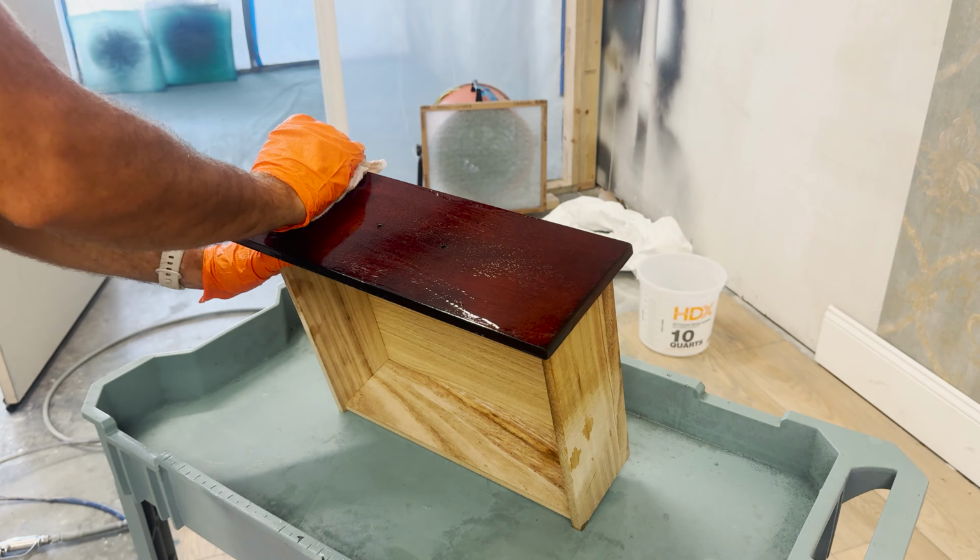But really, the main thing to consider is that these coatings are a lot harder to spray than a lacquer, in the sense that they have to remain dust-free for longer, but not as long as something like Fine Paints of Europe. So that's why I use it. It's a good middle balance. You get about the same gloss as Fine Paints of Europe, but not as long a working time, and you can cut and buff it.